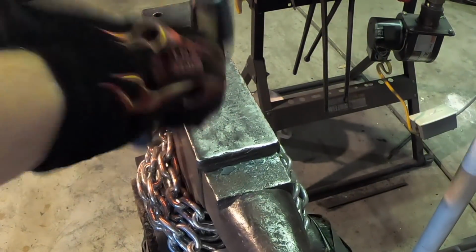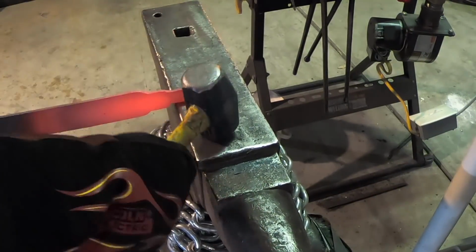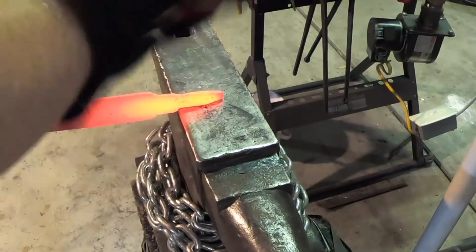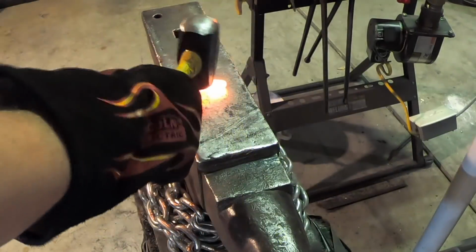This dagger was much longer than the amount of steel that I had, so I couldn't just cut it out. I did have to forge as much as I could to save on steel. I also didn't want to thin out the blade too much. Because it was a dagger and it was going to get 4 bevels, I wanted the center to have a bit of meat to it, so I tried to keep that as close to 3/16 as I could.